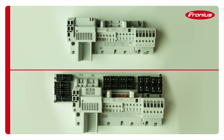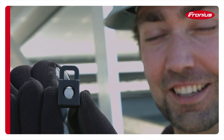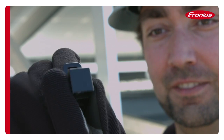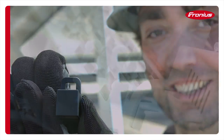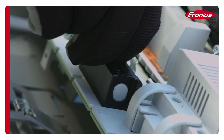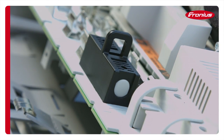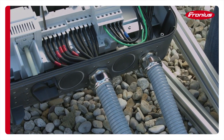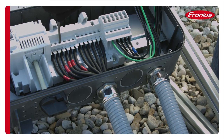There are two variations of input terminal blocks. One comes with the option to place fuses for all inputs of DC plus and DC minus; the other is a direct pass-through. The fuse holder has an open and closed side. When installing on the fuse print, make sure the side with the opening lines up with the white standoff. Tighten the screw terminals with a torque of 1.3 foot-pounds.